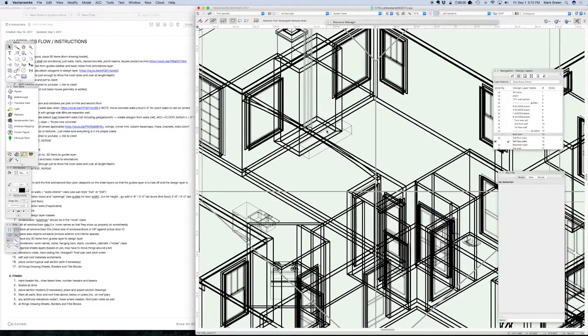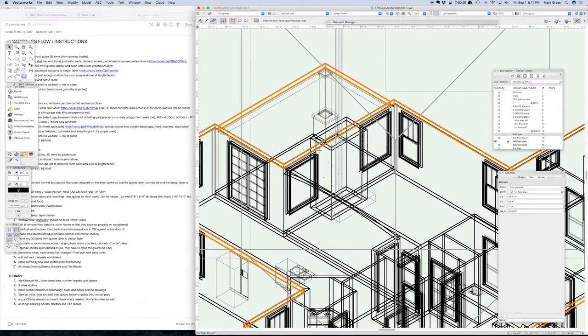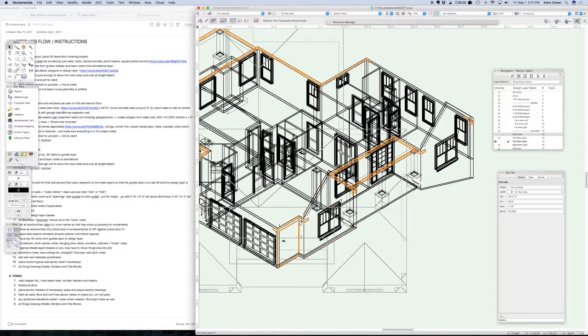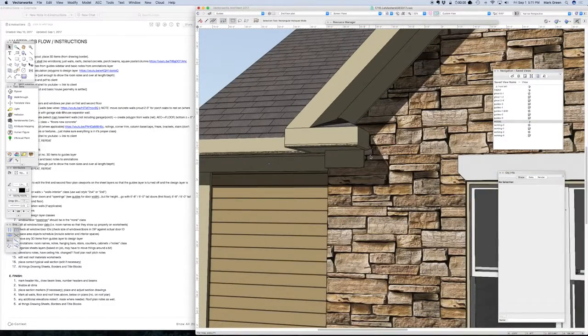So again, this is where I ran it. You can see I ran it both around the porch beam, and then I also ran it up against the house. Same on the front. Stop short of those little roof returns on these gable ends. Stop 2 inches short of those.